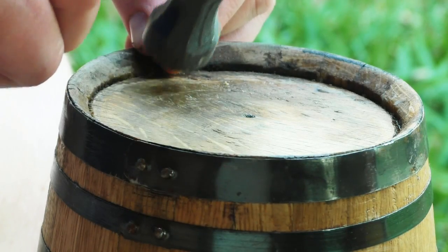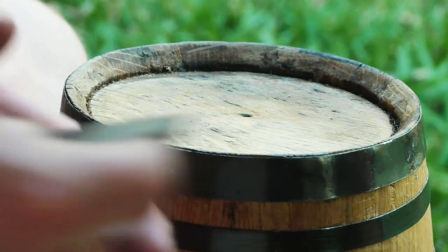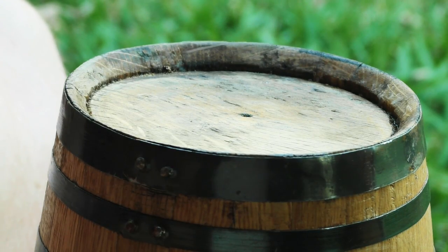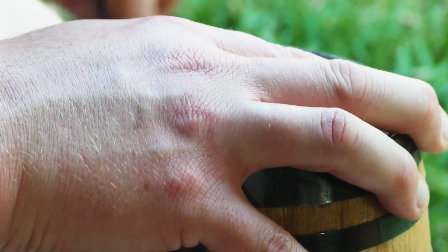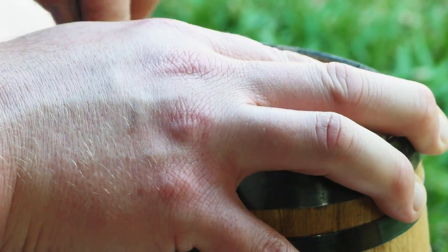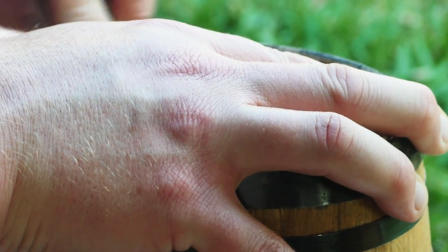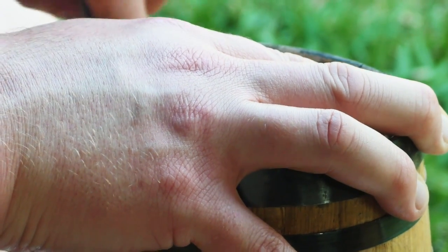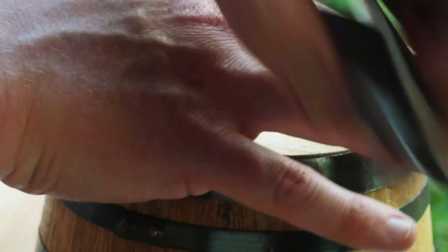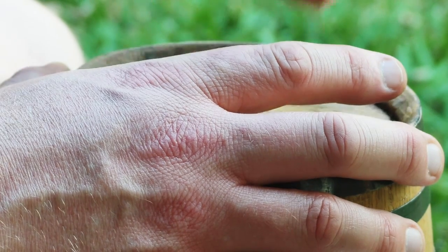Too blunt on the end or not. Alright, we're going to try doing a little sanding. Because when you scrape across the wood like that, you're opening the grains when you punch into it. When you sand it, you're sealing up the grains, so hopefully just do a combination of all that and get it to seal up.